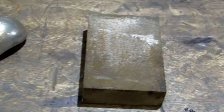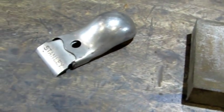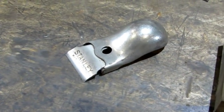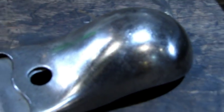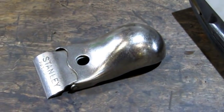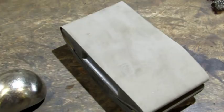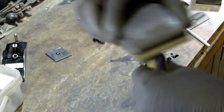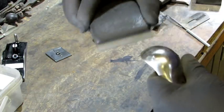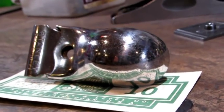What I'm going to try doing is use my sanding sponge and buff it up, and if that's good enough, go over to my buffer and polish it out. After just a couple of minutes with the sanding sponge, I can see there are quite a few small dings all over the outside, so I'm going to go over it with some 1000-grit paper before I take it to the buffer. That 1000-grit paper is going to shine it up really nice — and that's quite an improvement from what it was before.